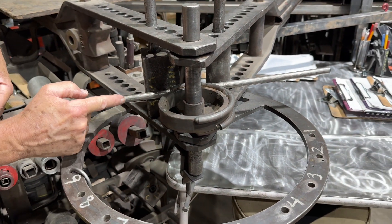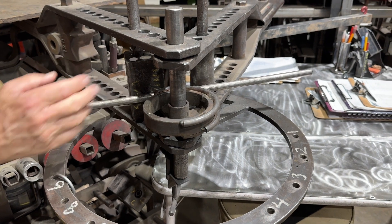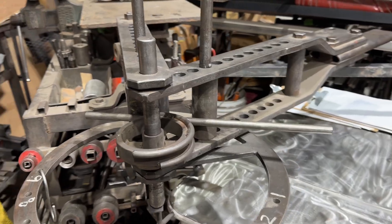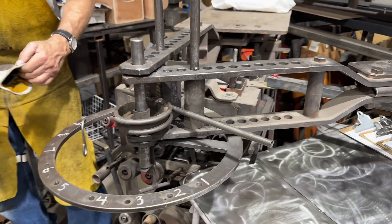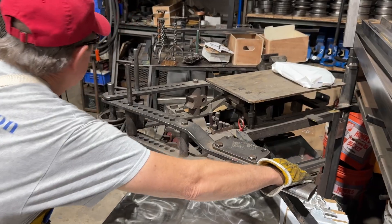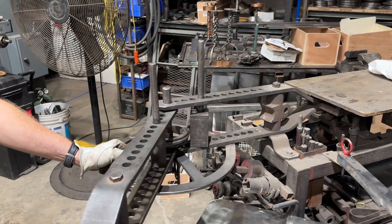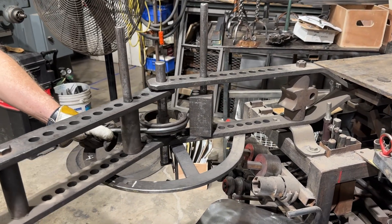What's really important is that the back end not slip forward, because then the tube will kink immediately. So this has got to be held very securely. So I'm going to go ahead and make the bend. I'm going to gently pull on it, and I can see right away it's not going to move.